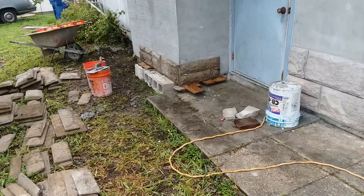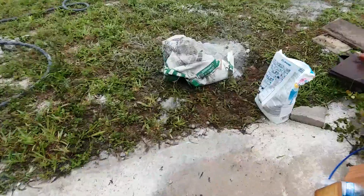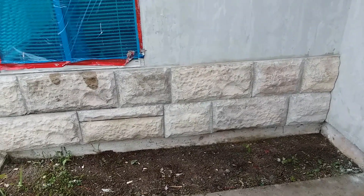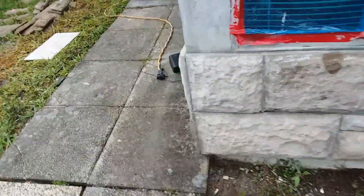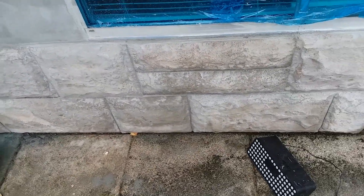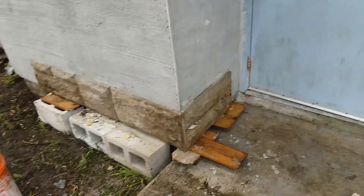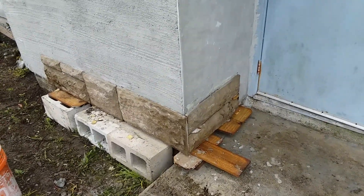It's more of a darker color stone generally. You can see over there where it's a little more wet — this will darken up too. I rubbed some pure mix of Titan stucco on it and it made it a little more gray. I'm gonna paint this house gray. That's one little trick — they sell cementuous coloring and you can add color to anything, even a lighter color stone or stucco.